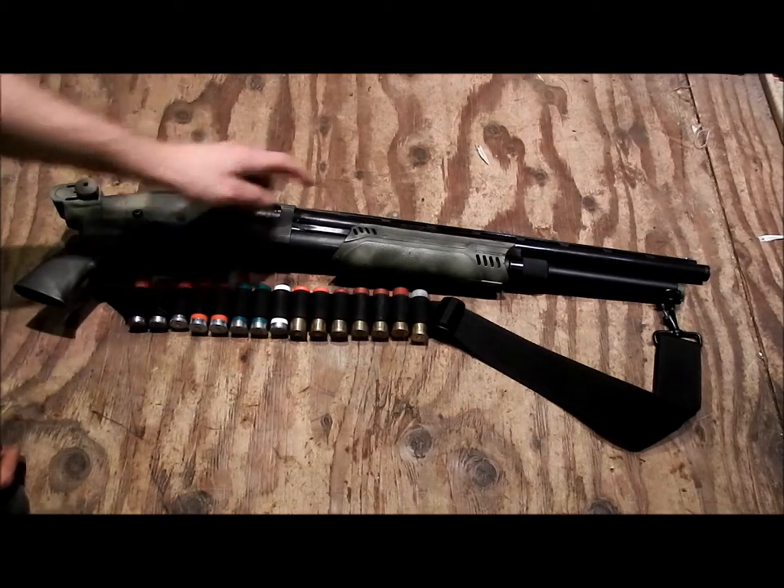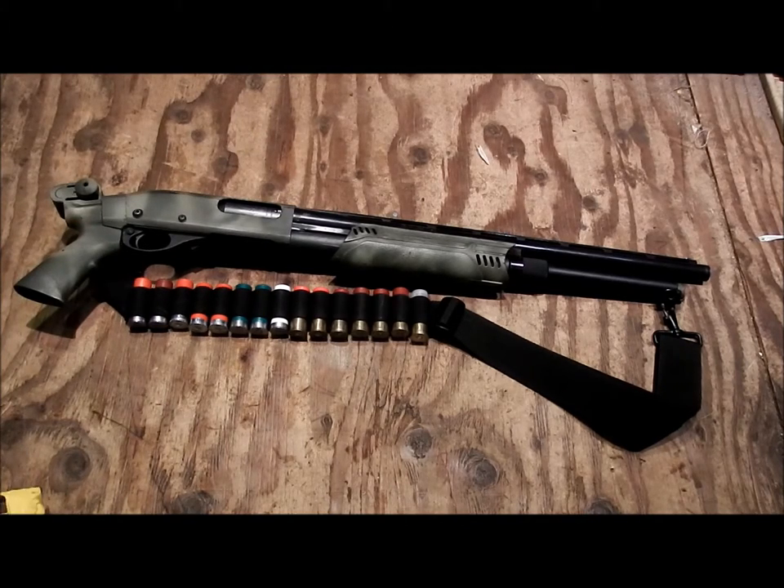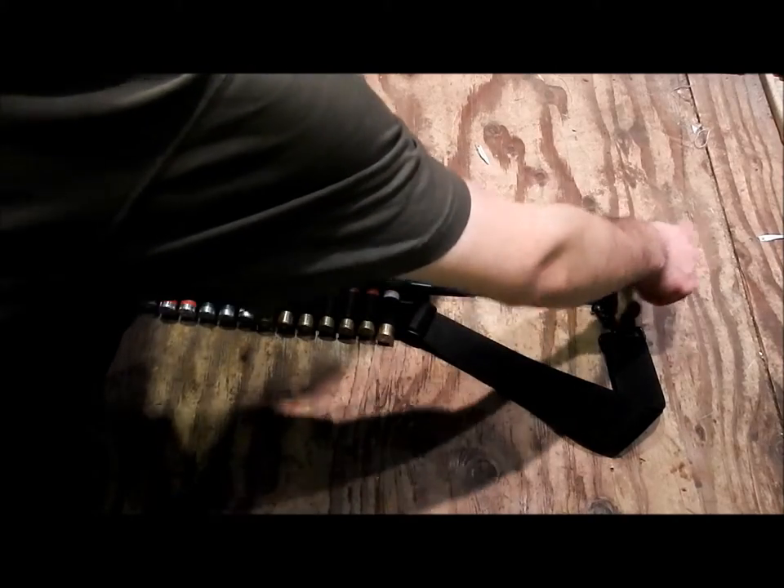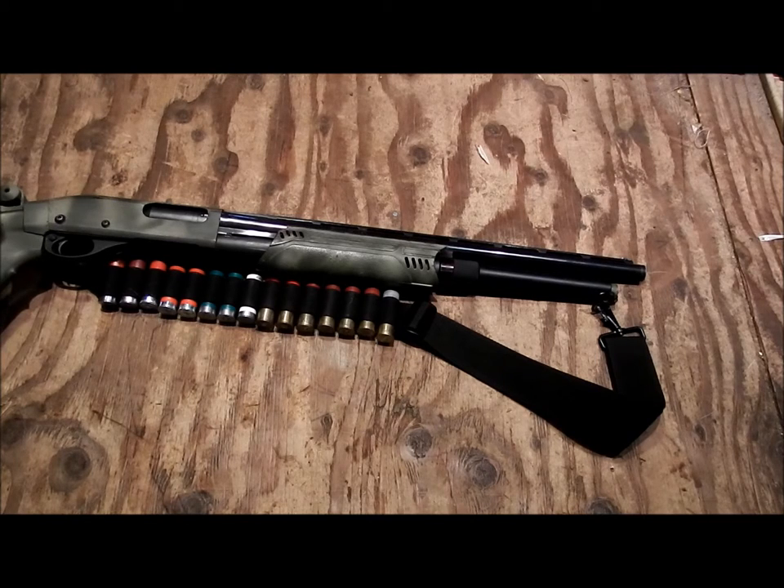Usually the barrel is measured to the front of the breech before the round actually goes in, so there's still some room to play. I took a hacksaw and cut the rib between the two barrels to make some clear space. Instead of using a hacksaw like most amateurs do, I used pipe cutters — because you get a perfect cut. You still get a burr on the inside that you have to take out, otherwise you've technically got a full choke, so there's still filing involved even with pipe cutters.